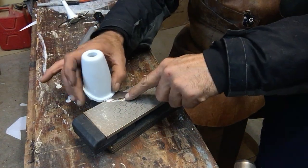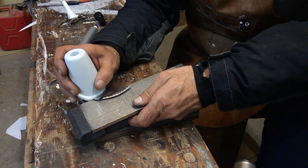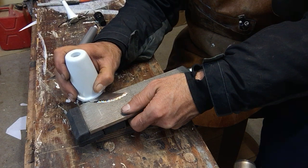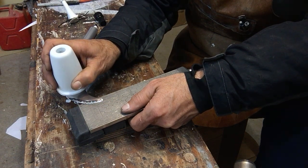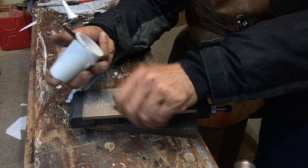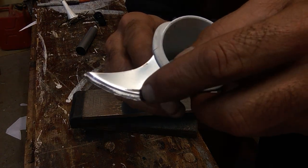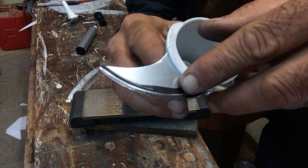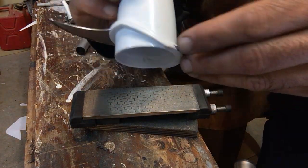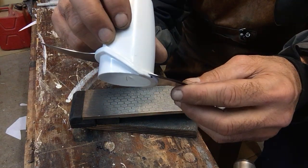So that tells me that I actually need to put this on a slight angle. I know this already had to go before. So I'm just going to take it from its flat position, roll it up, and then thinking about that angle through the curve, have another crack. Give it 2 goes. Now when I flip it over, you can see that I have actually sharpened to the back of the serrations, and for all intents and purposes you could say that's done. If you have sharpened off the serrations, remember this is pretty cheap metal, so it comes away pretty fast.